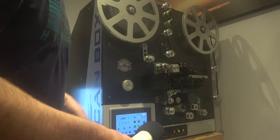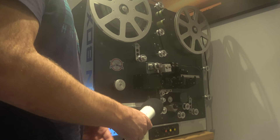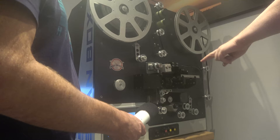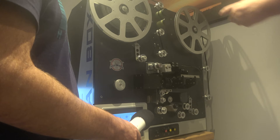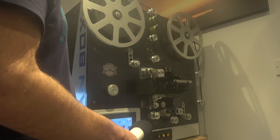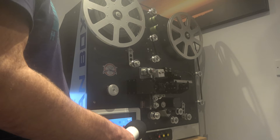How do you keep that lens dust free? The best way is with air — I have my little air canisters. But the focal length on that is so tight between the lens and the film; even if there was dust on the lens, it would not be picked up because it's almost focusing through it. A quick blast of air first thing every morning. This room is pretty much sealed, it's not a very dusty room. Any dust that comes from the film is picked off by these PTR rollers before it even gets there. Wouldn't it be wonderful to have a vacuum-controlled dust-free room where we're all in white suits? I don't think it would make that much difference, but it might push the costs up a little.